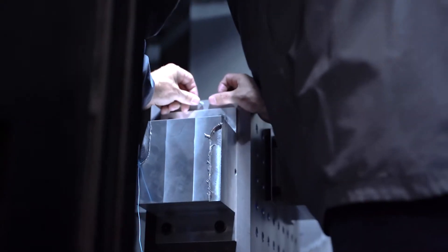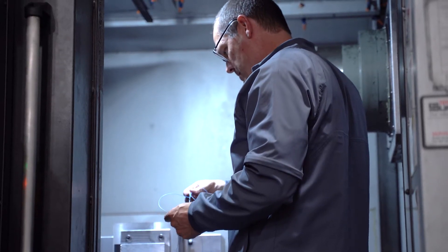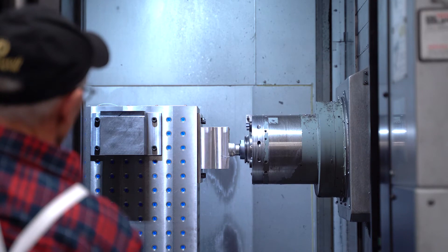The comparison of the four materials for the tombstones yielded some surprising results. What we saw was a tremendous difference in damping, or energy dissipation, in the epoxy tombstone relative to the other materials. The lowest-ranking material in terms of damping was the aluminum tombstone, and then epoxy was far and away the best.